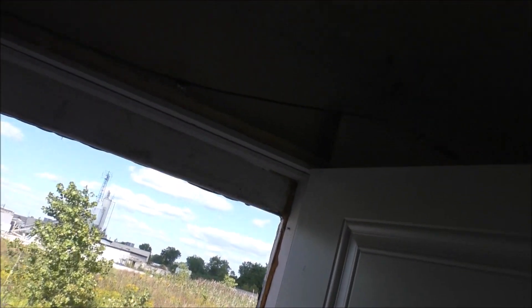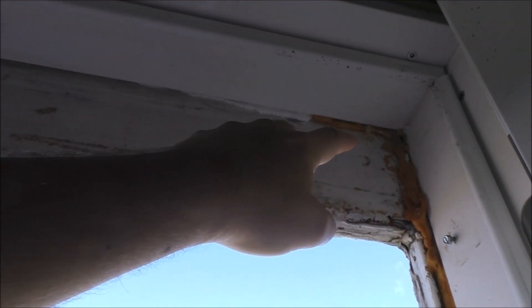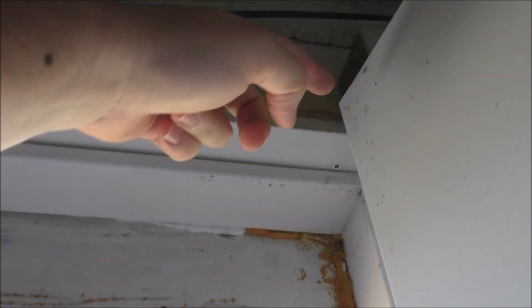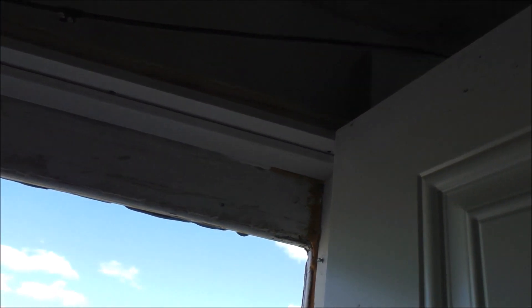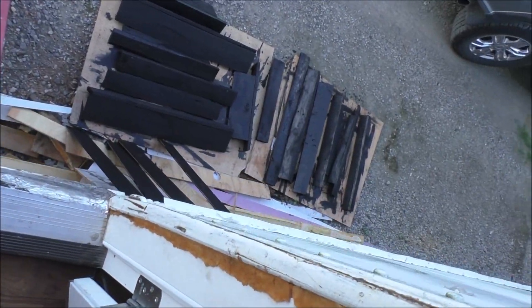Above the door when I was up there, I noticed I could see daylight through a crack. Since that's outside air coming in, I spray-foamed the whole seam up above — you can see it coming through here. This corner might be due for another hit, but I foamed all of this so no air is infiltrating through the chase and hopefully keeping all the bugs and critters out.